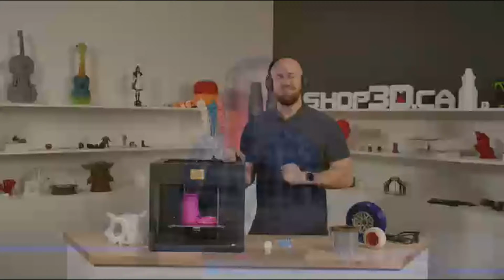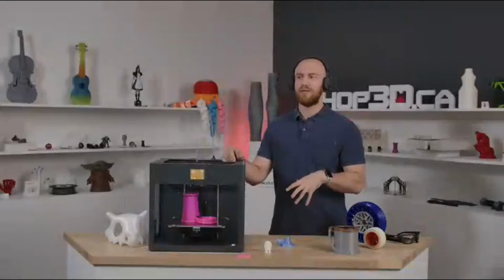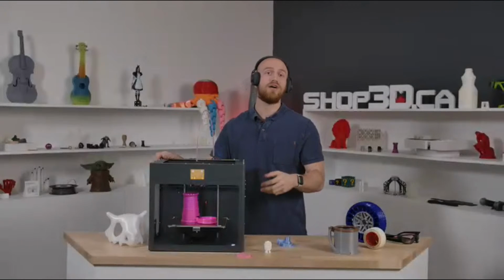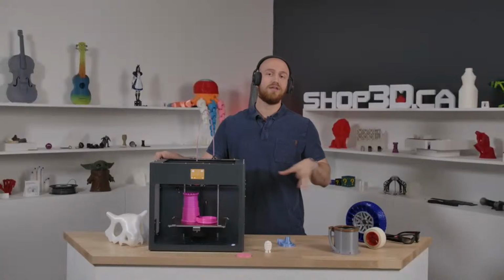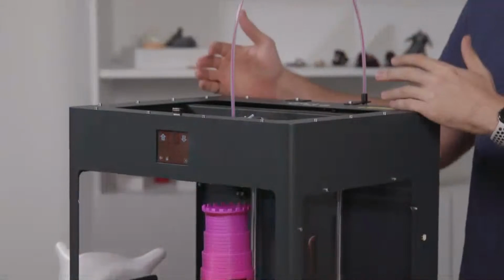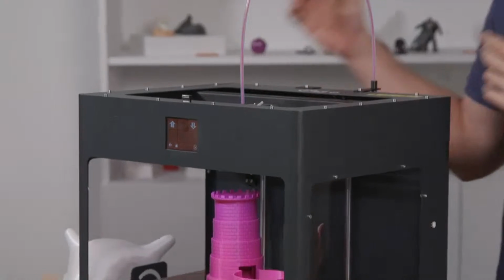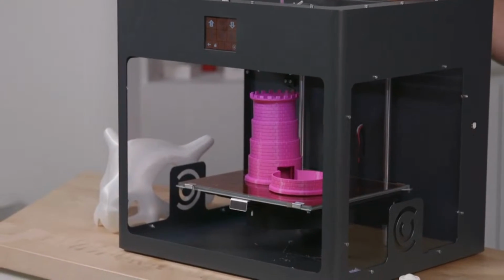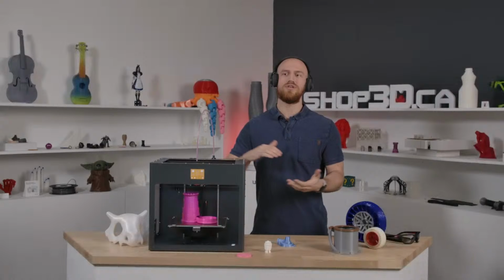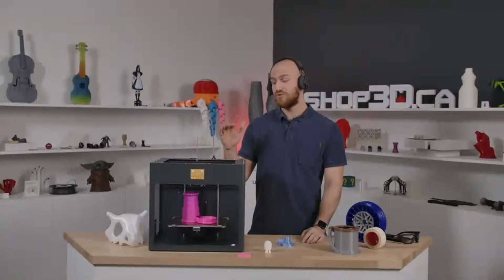Yeah, and it's extremely quiet when it was printing, so I can see this working well in a library environment. Jack, hey, Ken, let's go to you. Yeah, sorry, go ahead. I did want to touch on a couple of features that we didn't mention that might matter to people. Both the printers, any of them actually, have not cloud connectivity, but they have Wi-Fi. So you can hook up your software directly to the printer over Wi-Fi and send your parts that way. The other feature, which might not be super important here because the build volume is a little smaller, is a power resume option. So for a big printer like Jackie's, if you're printing something really massive and somebody disconnects your cord, or you have a quick power outage or a long one, you're able to resume the print from where it stopped. So you're not going to be losing hours and hours of printing, which are two great features on this machine. Yeah, that's definitely great. And thanks for bringing that up, Felix. I almost forgot about that.